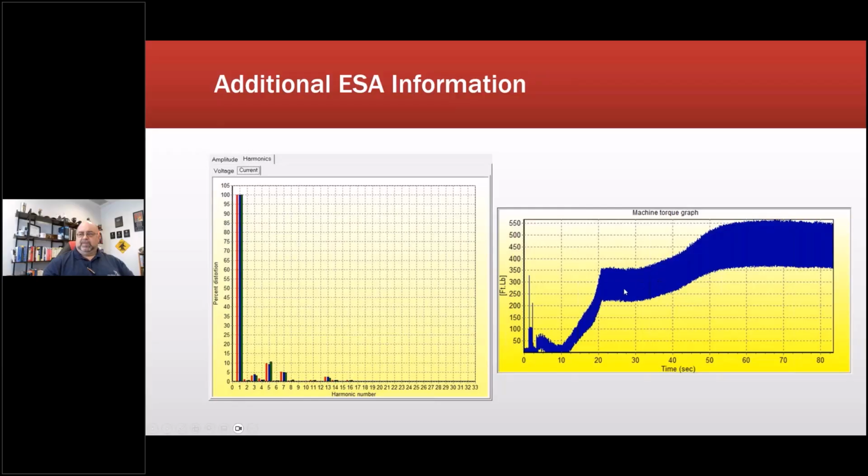The other thing we noticed was during that startup, we have the impulses and everything. Then as it comes up, the air gap torque increases as the load comes up. That was very interesting, especially when we started looking at what those frequencies were. We were able to pull out that those frequencies are coming back from the grid to the wind turbines, so they're causing a subsynchronous resonance in the air gap of the machine. That subsynchronous magnetic resonance was causing fatiguing of all the Y rings and all the components.